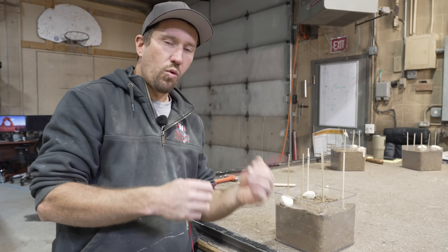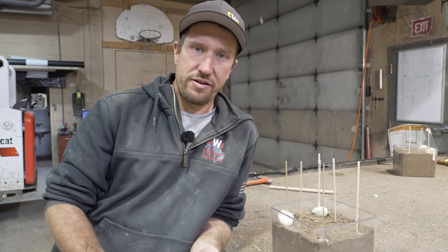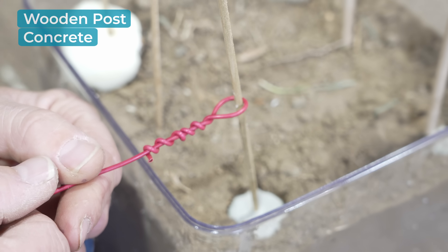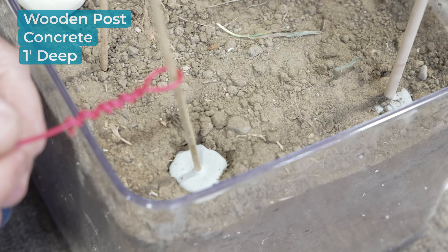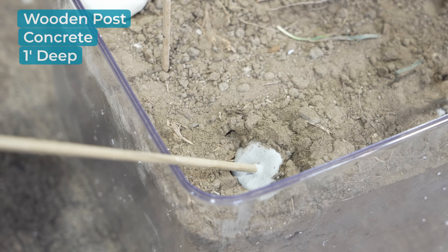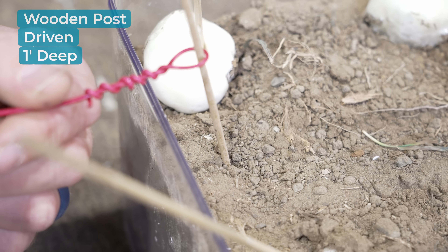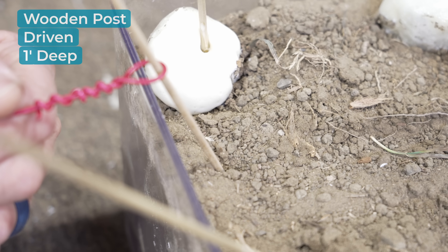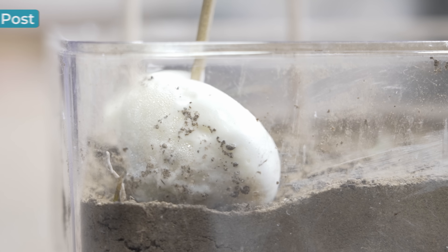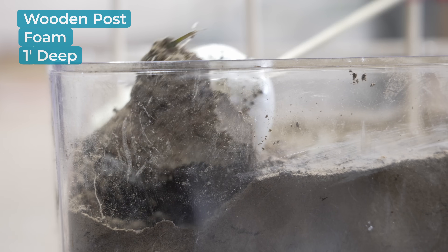This is one foot — we're going to see what happens. Are we going to have a dirt separation from the concrete or the foam? Is it just going to pull right out of the dirt because it wasn't set deep enough, or is it going to break? We're tying on about three quarters of the way up, and already it's just starting to buckle the topsoil. It didn't even put any stress on the post — you can see it's pulling away from the soil on the back side and the soil is giving away on the front side. The post is already leaning over, so that's a fail. Here's the foam — it did exactly the same thing as the concrete.